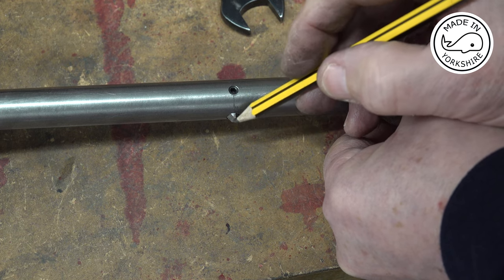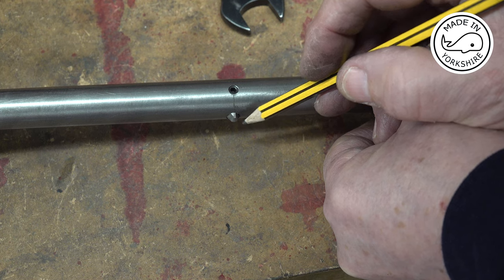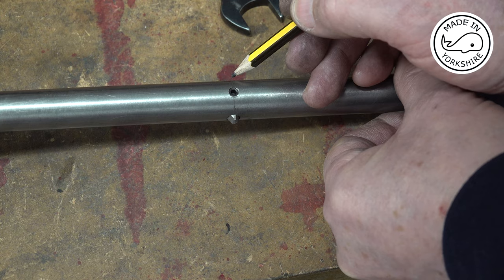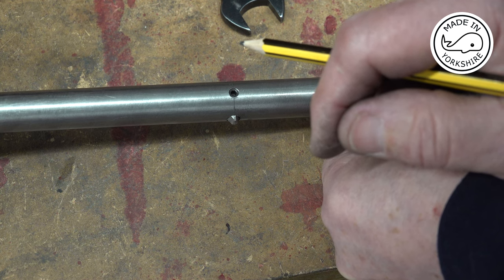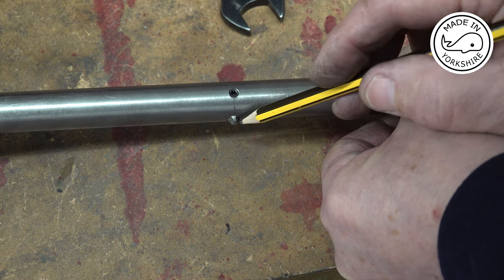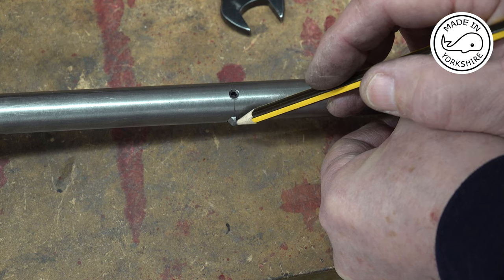So to get the overall diameter that this is currently set to, I need to add another 0.1080 onto 0.8545, so it's just like the tips out here, and that comes in at 0.9625. And I thought I was about 40 thou out when I machined the bores. So currently I think that's just running freely inside the bores, which sort of makes sense really.